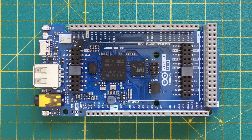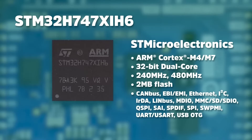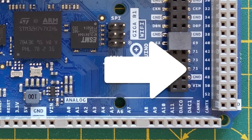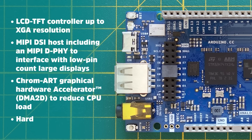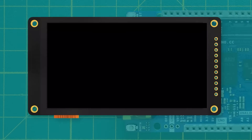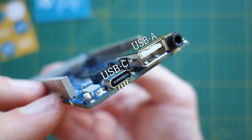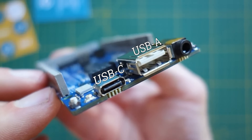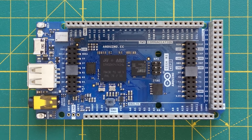There's a new Arduino board on the scene: the Arduino Giga. I'm linking to Switch and Lever's review of the board here, and this might be one of the most feature-packed Arduinos ever made. There's a Cortex M4 microcontroller with a built-in real-time clock and 75 digital GPIO pins, an audio jack with a 2-channel DAC, a 2D graphics accelerator, and a DSI header for camera and display breakout boards. There's a USB-C port for power and programming, but there's also a USB-A port for hosting HID peripherals. If you're looking for a no-compromises board for your next project, check out the Arduino Giga.